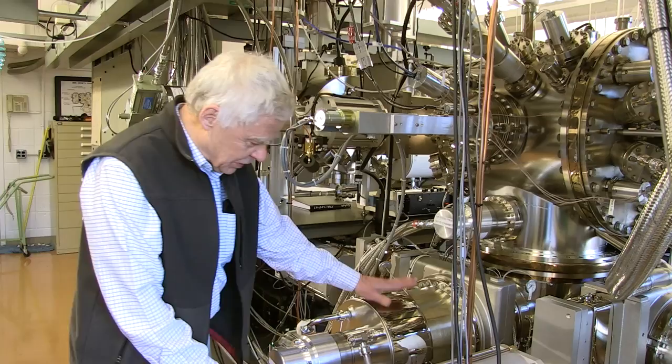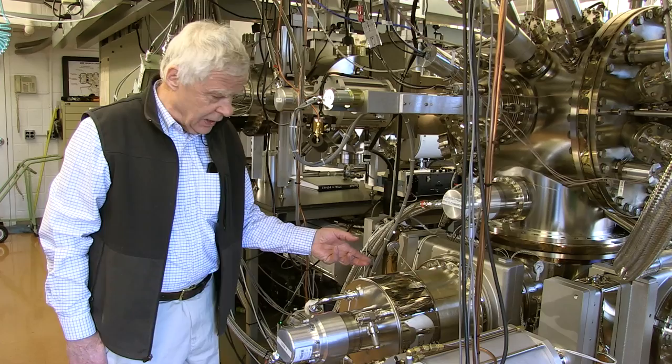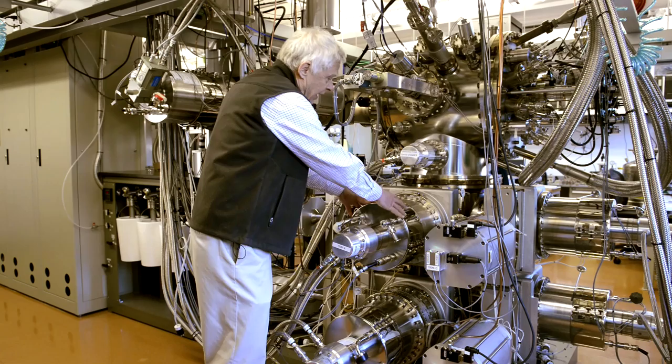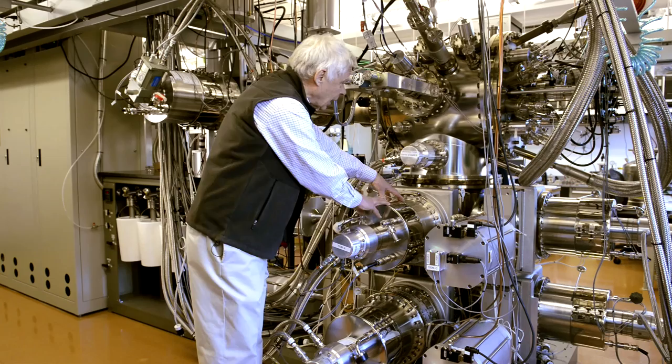These four cylinders are our four vacuum cryopumps. The noise that you hear is the piston mechanism in each of the four pumps that cool a surface to near absolute zero. When this surface is at absolute zero, all of the gas molecules inside of this pump stick, and that makes the vacuum superbly low. And with that very good vacuum, we are able to grow our high purity crystals of gallium arsenide.